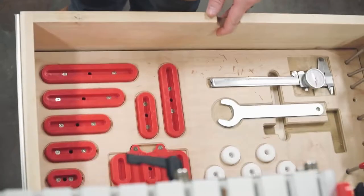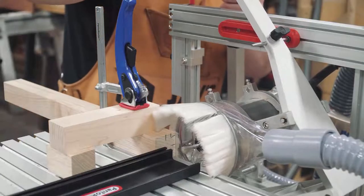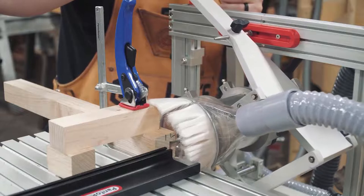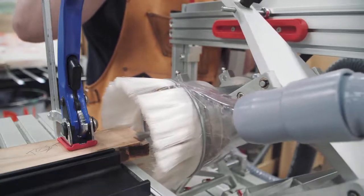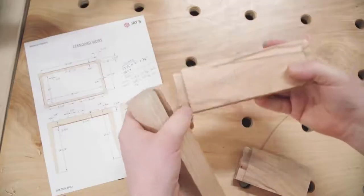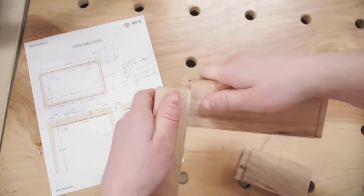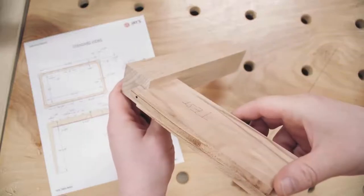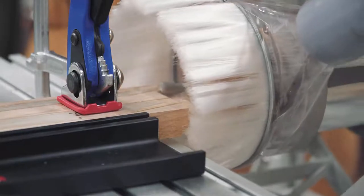The rail-to-leg joint will be a sliding dovetail, and both sides of the joint are cut using a single template. The inside of the template allows the negative part of the sliding dovetail to be cut, and once a test piece confirms the correct setup, all eight negative cuts are batched out quickly. Then the machine is set up to run on the outside of the template for the positive part of the sliding dovetail. A test piece is used to dial in the perfect fit — the target is a tight fit that doesn't require a mallet for dry assembly. When hide glue is used it will slightly lubricate the joint, but due to the glue's thickness and the already tight fit, a mallet may be required. All eight positive cuts are then batched out quickly.